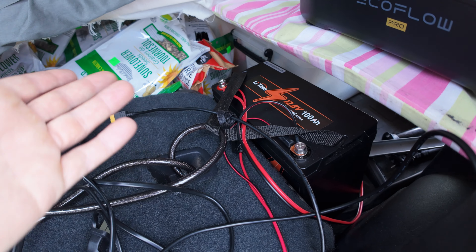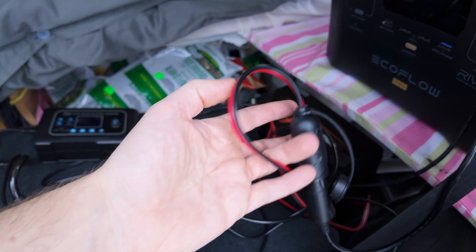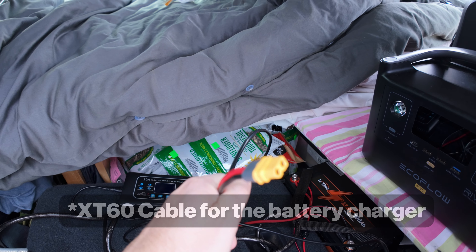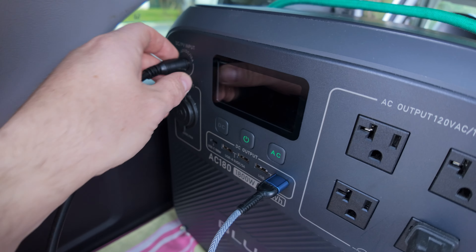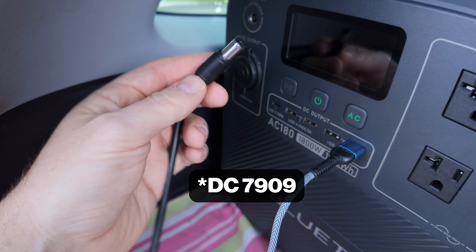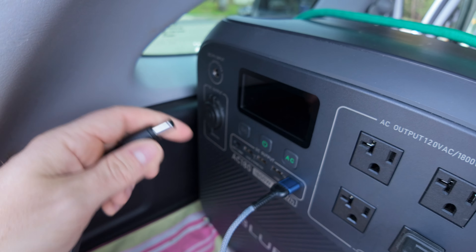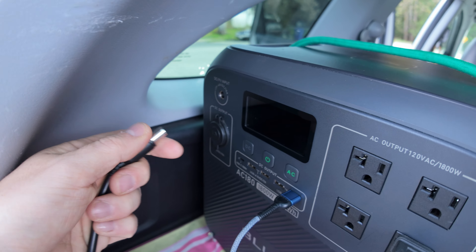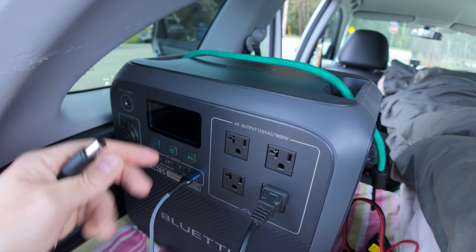To save you the hassle I went through finding the right cables, I'll link everything below: the cigarette cable with the fuse, the adapter cable for the EcoFlow (which uses XT60 yellow connectors), and the Bluetti cable (which uses a DC barrel plug — DC9 or DC10 style). Just make sure you know what plug your unit uses and get the right adapters. Hopefully you got some good value from seeing my power system and how I set it up with the LiTime battery. Let me know in the comments what you're doing for your own systems — I'd love to hear. Be sure to subscribe and I'll see you in the next one.